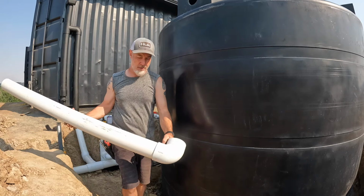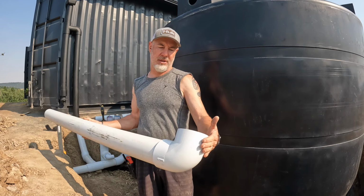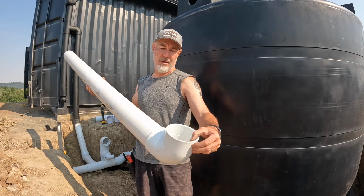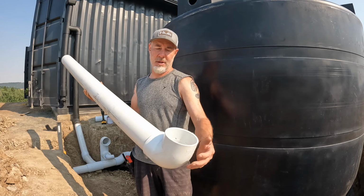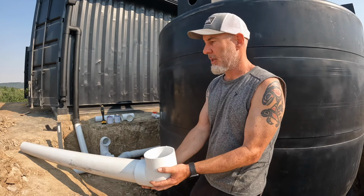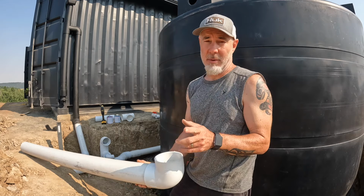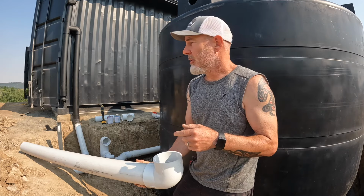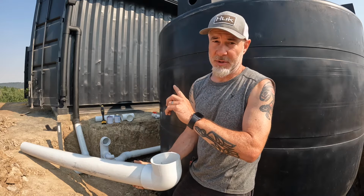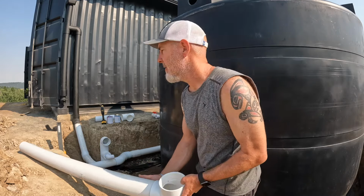Basically what we're gonna do is take a 4 inch piece of pipe and glue an elbow on here, and then it should be 64 inches to the inside of this elbow, because that's gonna ride up along there. The fittings are about 1/4 inch wider than the pipe is, so I wanna make sure I measure to here. Before we get it tied into the top here, I wanna glue this up and have it supported by something, because the pipe that comes up out of the ground, I want to paint black like we did with the downspouts. So I'm just going to mock all these up. Then we'll take measurements, make the pieces that go into the tanks, and then throw them on the sawhorses and paint them black so that they match the barn and the tanks and all that stuff.